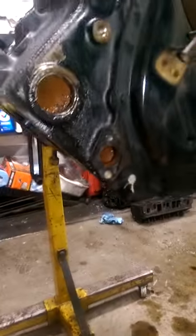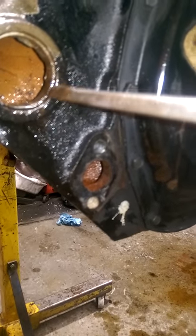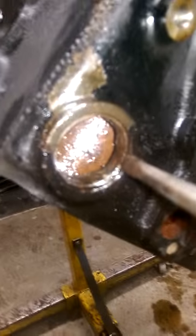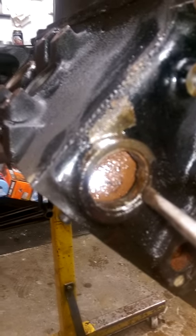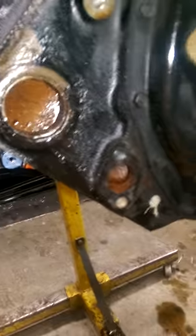At this point it's going to take maybe thirty seconds. Get a flathead screwdriver - make sure it's got a pretty fine point, not one with a blunted or broken tip. You're going to be really careful not to score the bore - tuck it in so it's held and not going to slip. I've watched people Dremel them out, skill saw them out, try all kinds of things, taking an hour to get each one out. Once I get that center out, I'm getting these things out in thirty seconds.